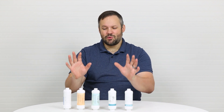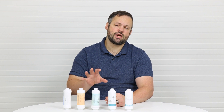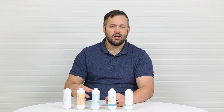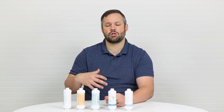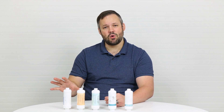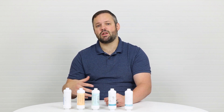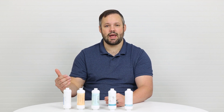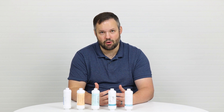How often do you need to change one of these filters? Manufacturers recommend changing them every six months. If you find that the water flow or water pressure starts to lessen, it might be time for a new filter. In rare cases, if you have really hard water and start to experience that, it may be time to change a filter earlier than the six-month period.